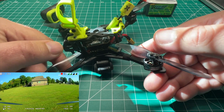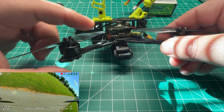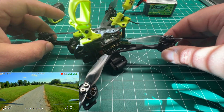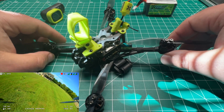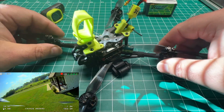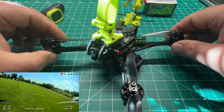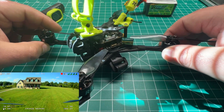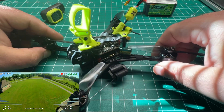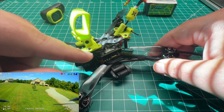I'm running a slightly higher KV at 3800. I don't think I set up motor output limit. Here's the Betaflight setup on screen — I'm running Betaflight 4.3, the first quad I set up on 4.3. I always take time to transition to new versions and make sure they're stable. I did flash the UAV Tech presets for toothpicks and it's been flying amazing. I also flashed the latest version of Bluejay and enabled RPM filtering — I'll post the link to that video.